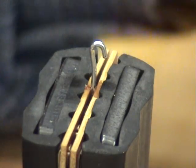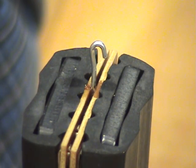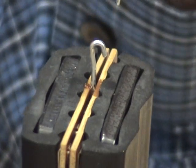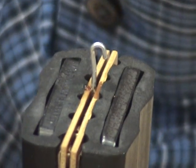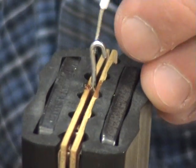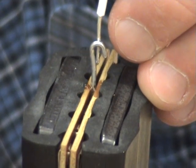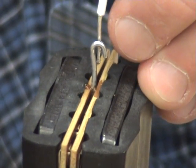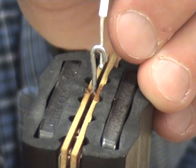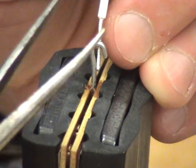Okay. Step 1I, place the wire up against the bottom of the hook. All right, that wire that we tinned in the previous step, our previous subject, I'm going to take it and place it up, that tinned wire, place it up against the terminal. Okay. Step 1J, wrap the wire tightly around the terminal.